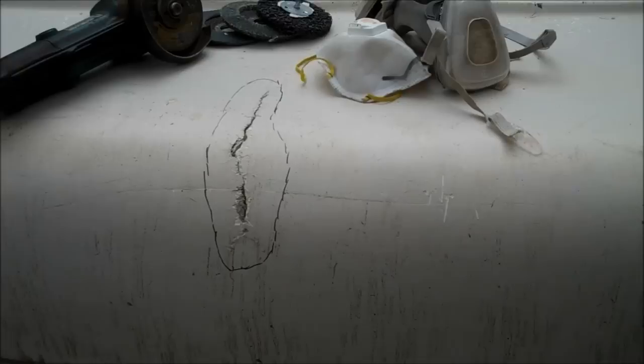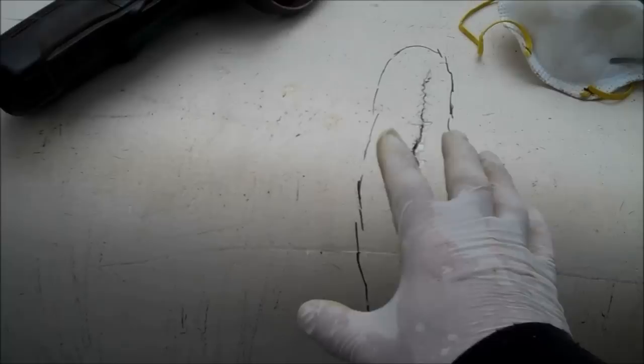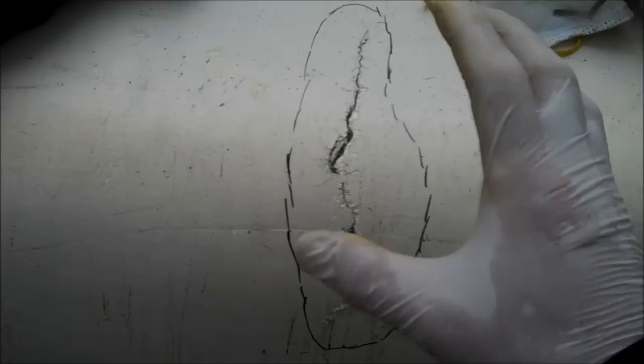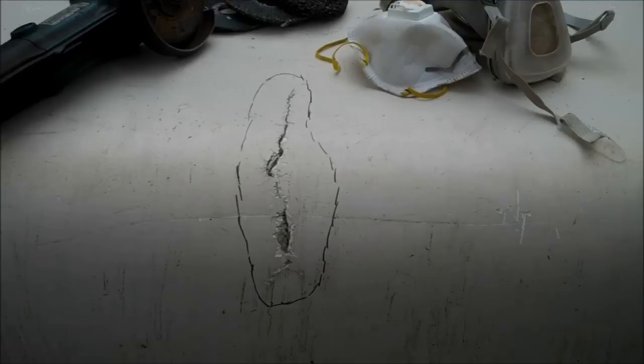The one thing I want to avoid is making this repair much stronger than the rest of the canoe — that doesn't do me any good. Actually, then I'm creating a weak spot where the patch meets the rest of the canoe. So I'm going to try to make it stronger than it was originally, but it just won't be one big glob of super hard resin. I want it to flex with the rest of the canoe. Keep that in mind when you're making repairs like this. That wouldn't matter as much if I was doing this on an automobile bumper, but on a canoe you still want to maintain flex in the material itself.